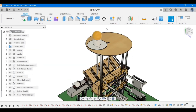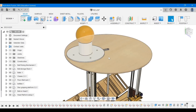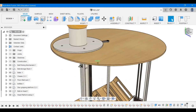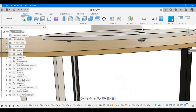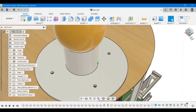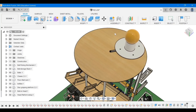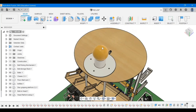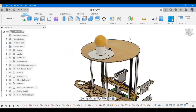For the anti-interception mechanism, the ball on head placed on the ball holder is rotated on a circular platform. The holder has caster wheels attached at its base, allowing smooth motion of the plate on the platform. The setup is driven by a motor fixed at the center of the platform. The rotation of the ball on head reduces the probability of the ball being hit by the opponent team.